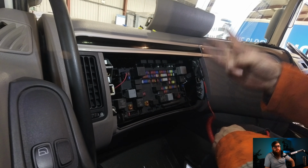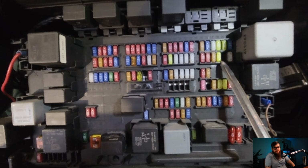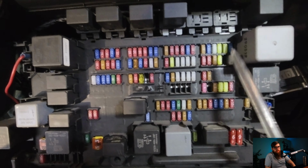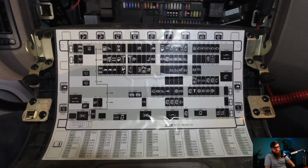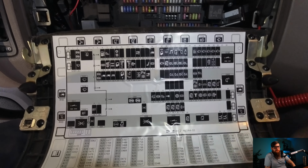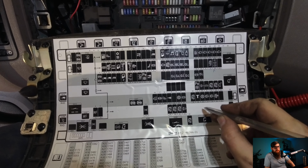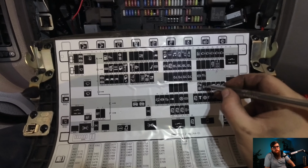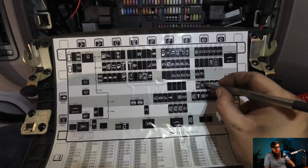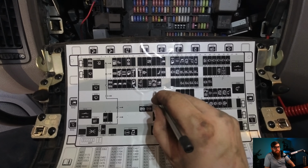Anyway, here we go, 3 blown fuses. What fuses do we have blown here? We have B29, which would be E027 as it would be found in DAF's diagram, which is the 12-24 volt converter. Not really what we're looking to fix, but hey ho. D26, aka E443. This is important as it's our power supply to the EAS unit. And C14, which is E114, our auxiliary heater fuse.